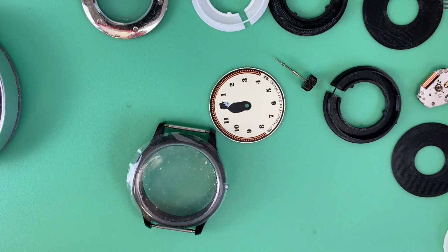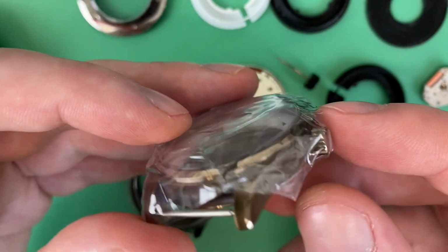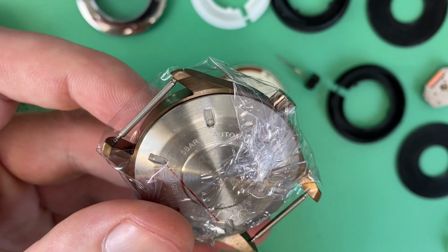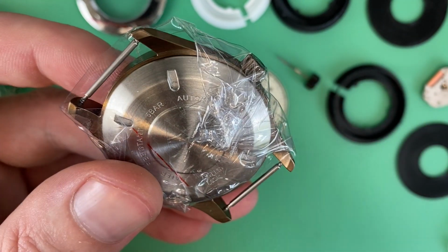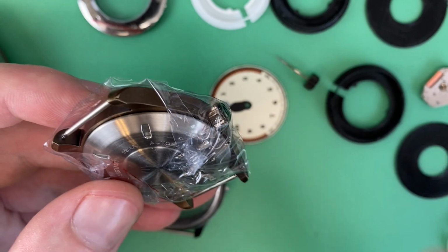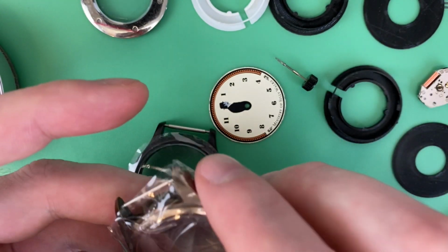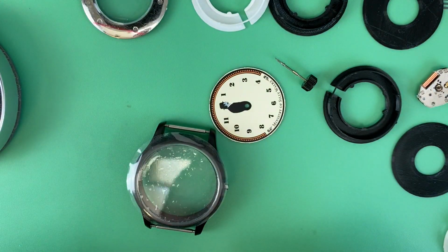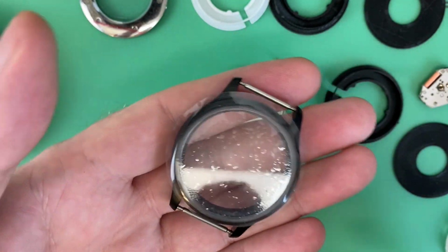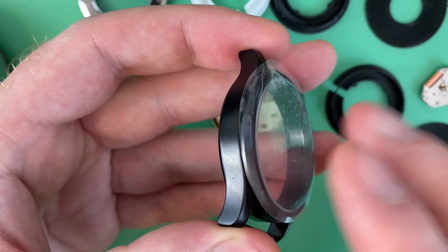I thought, well, what color case would look good? And I considered some stainless steel cases. I thought about using this bronze case, and so I got it and tried it out. I figured that the dial size was going to be a little issue. The dial's a little bit too big, and I probably would have had to shave off more of the dial than I wanted to. Finding a case that will fit the exact dial size, which if I recall is just 34.5, can be an issue sometimes. I thought it would look good in the bronze, and it would, but this one just wasn't going to work because the dial needed more shaved off than I was comfortable with. So I landed on really the only option out there that I could find, at least to buy a case for it on the open market and not get something custom made, and that was this black PVD case.